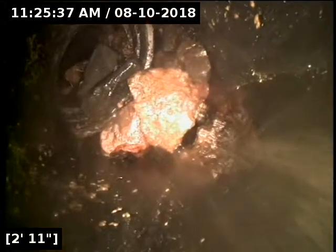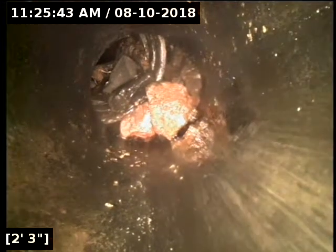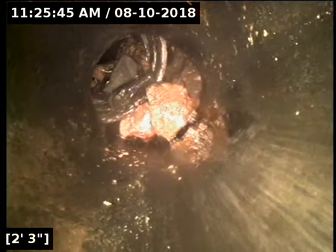Okay, I'm going to go ahead and reel the camera out. I've marked this as best I can out front. You'll see a big white bunch of paint in the bushes there. It's as best as I can do. The bushes are so thick I can't get the locate right on top of it, but I'm picking it up at about 2 to 3 feet deep. It should be very shallow. I recommend that be repaired there and then re-scope it to see how the rest of the line looks.